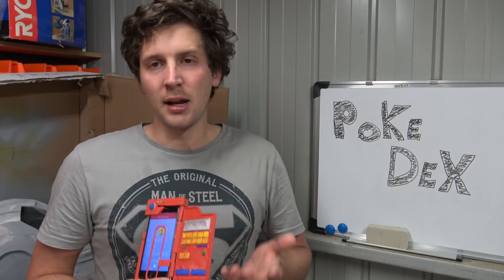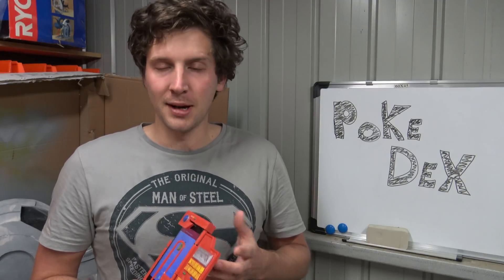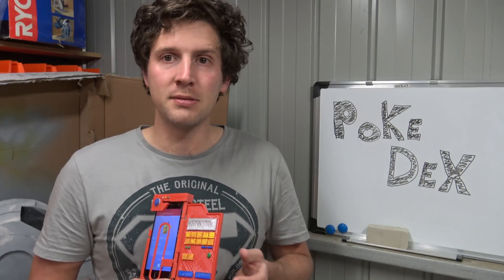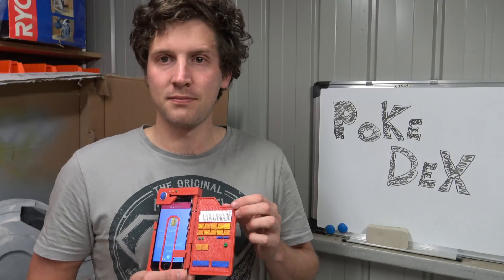The version I have made for the Pokedex is really only a quick rush job. I've been really busy with work this week, so it's been done in a standard 0.2mm resolution of printing. I haven't acetone polished or anything like that. It is printed in ABS and I've just rushed and done a really average paint job on it.